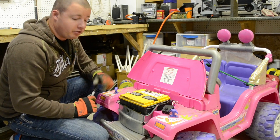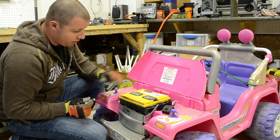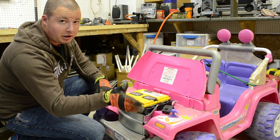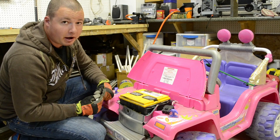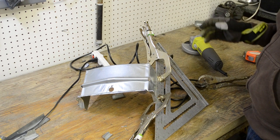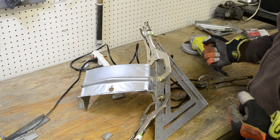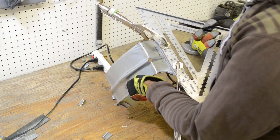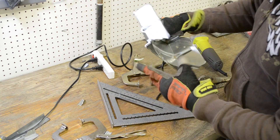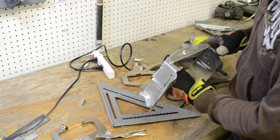So far the fit is looking really good. I'm just going to need to trim it along here to knock that little lip off. We got our marks for where we're going to bend the flange and tie into our battery compartment. I have a square attached to the battery bumper and we're just going to make a straight bend with that edge, giving us a good 90 degree angle for our flange to attach to the battery compartment.